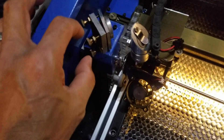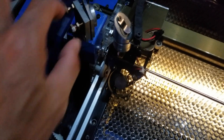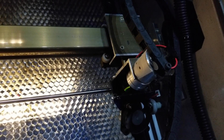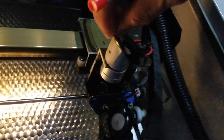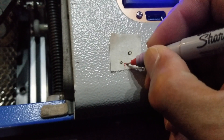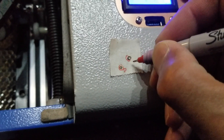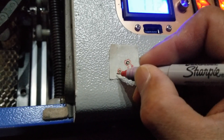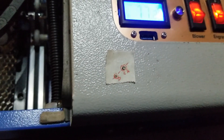To figure out the relationship between A, C, and D, let's start with an axis that's already aligned. We take a test shot to get our A, then I'm going to tweak the mirror a little bit to put it out of alignment, and then we'll take two test shots to figure out where C and D would be when out of alignment. If I mark out the three spots — first D, then C, then A — you'll see that the three are in a line and that the A spot is actually outside the line between D and C, on the far side of C.